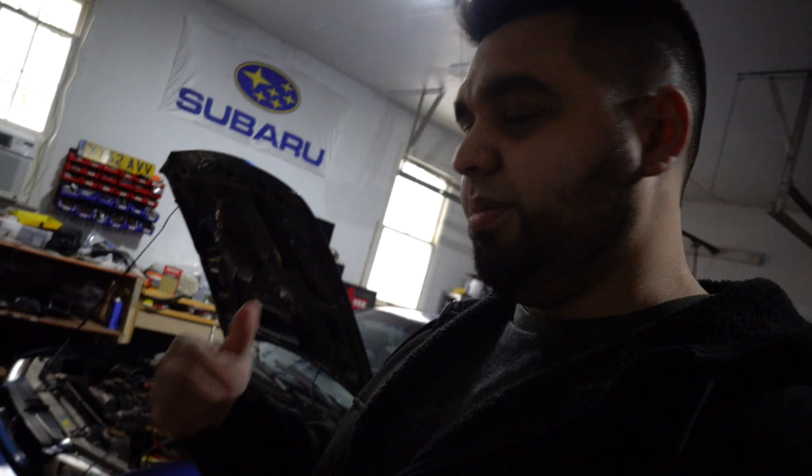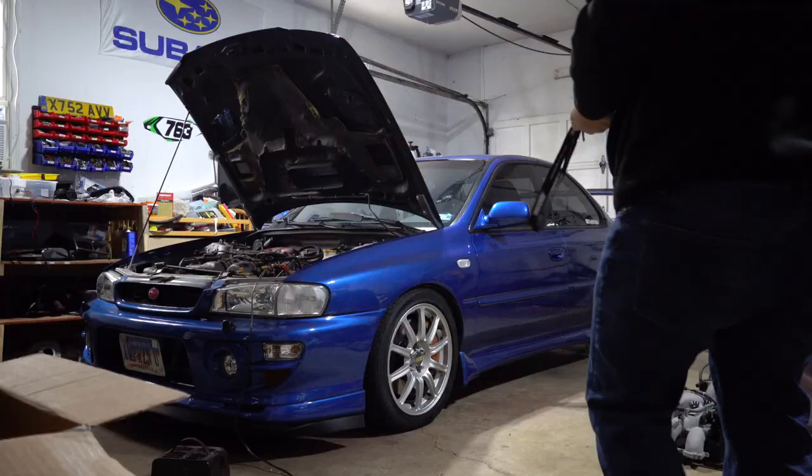The U-CAN you have to pump up with air, so there are pros and cons to both. We're going to test both out because we do have two bars to spray. I'm going to get this car out of here, hang the bars up — I have some hooks on the ceiling — and we'll hang them that way so we can get the whole surface. I think I have to clean them with a wire brush, then hit it with primer, then put paint in both systems, fill the U-CAN with air, use one system per bar, leave them drying overnight, and compare them once done.